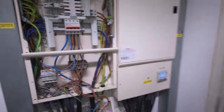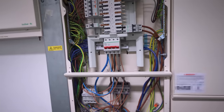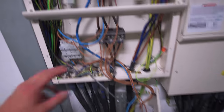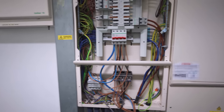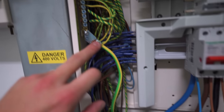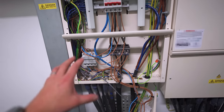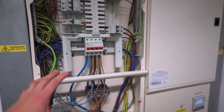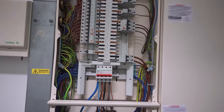These are the boards we're testing. We've been testing some circuits and looking at the existing systems. We've got singles just off the main switch doing the metering — there is a dedicated metering kit for this board, so that's not really great. Schneider spec also requires that you take the earth to this point first before going over to the earth bar, which they haven't done. Just little things like that we note down so we're not going to get caught out when we use these systems or need to change them.